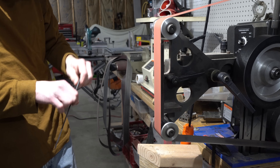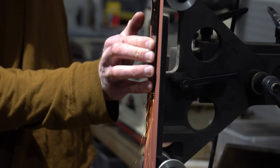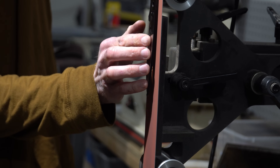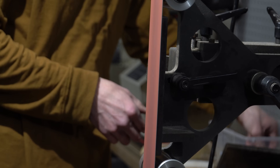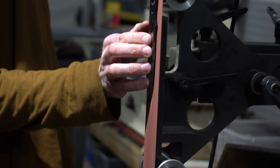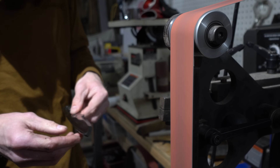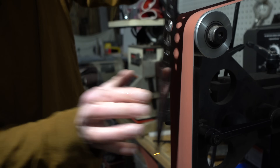Next, we're going to be back to grinding flats. Since the steel is hard, it's significantly harder to grind the flats. I'm using a fresh 120-grit belt to grind off the rest of the scale and make everything consistent. A quick tip when grinding flats using a ceramic belt: you need a lot of pressure and belt speed in order to remove the material. You have a lot of surface area coming into contact with the belt, so pressure is needed to actually fracture the ceramic abrasive to continuously expose sharp abrasive — otherwise you'll grind forever and get nowhere. Keep the knife wet and use your bare fingers to make sure you're not overheating the steel.